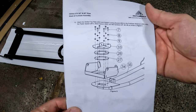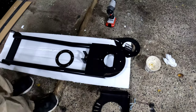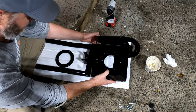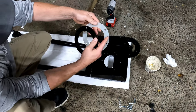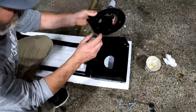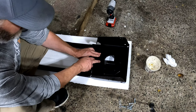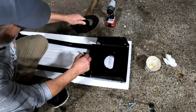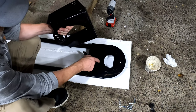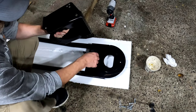So the first step is to get the push tube all set up. You have your push tube here, you take this bracket — it's going like that. The plastic goes at the bottom, in between it. You line up your screw holes and this goes on top. There are seven bolts and they're pre-threaded. Before doing this, I'm going to grease everything where there's metal-on-metal contact, since this is used in winter. You can see it already has a little bit of rust and it's brand new. So we're going to put some white lithium grease on it and then put it all together.